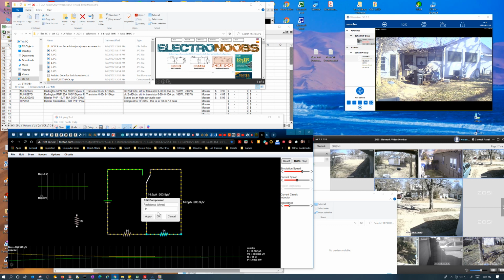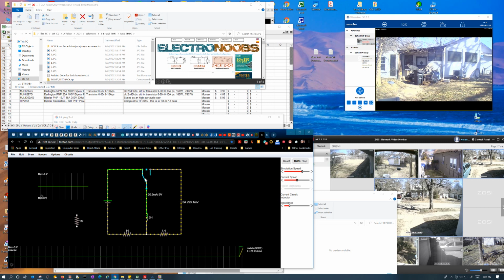So like I said, we go to a lower voltage on this, I mean a lower resistance, and charge it up, and it'll charge up really fast. Relatively fast. But then when I switch over, it's going to discharge back to our 1/10 of 5 volts. In other words, it'll be back to 5 volts, but at a higher current that it'll try to maintain for a longer period of time. So if you want current to be maintained, use a bigger inductor, store more energy into it, and discharge into a smaller impedance.